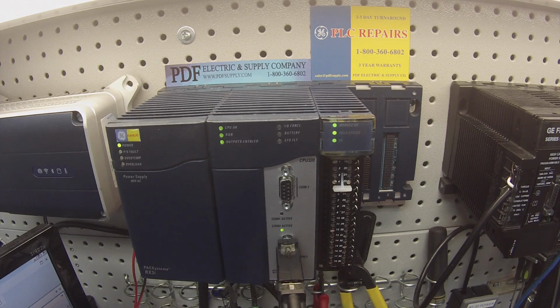The circuit must be stable, the circuit must give you a reading, and the circuit must give you an accurate reading for the amount of voltage that you're giving it. It should not give you a maximum voltage unless you're actually giving it 10 volts. Keep that in mind. The next thing is you would just carry through with your negative lead on 5 or 14, depending on which channels you're probing, and continue to probe the other terminal screws with your positive lead to go through and check all your inputs. All right,